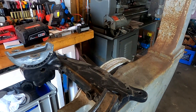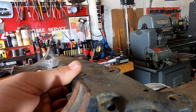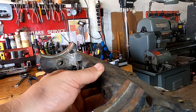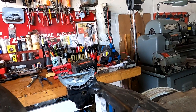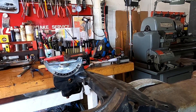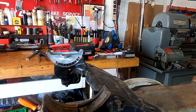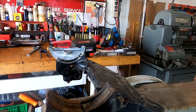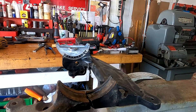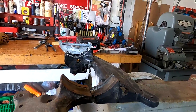So I went to one of the other saws I have and found another piece I can use in its place — but it's also broken right there. I'm going to use this piece because I know it's still good and not cracked here. I'm basically going to cut this end off and then braze it in like this. I'll have to chop some of that out, but I'll cut it on the saw and then prep it — grinding it, holding it in place — and then braze it in.